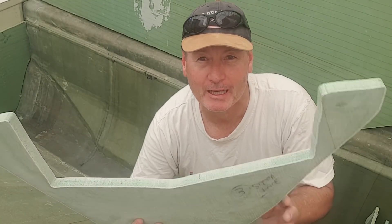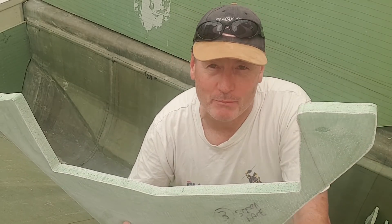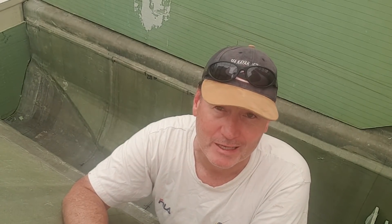I'm going to glass them in. I've got to put a layer of Sealight adhesive — ProBond light — in here, radius it, and fill it up before I can glass and tab those in. Remembering when I laid up the hull, the entire hull section here was peel-plied. It's been about 7 or 8 months since I've actually glassed anything in here, so I'm going to give it a light sand to clean the surface — just to make sure it's as clean as it can be. Even though it was peel-plied and the peel ply has been removed, there's still going to be contaminants: dust, possibly some moisture. It's 42 degrees in here today so not much moisture, but it's so important to keep it clean. I've vacuumed this section out, then I'm going to sand it lightly, then wipe it with styrene before placing the bulkhead. The filler is Sealight bedding compound — it's an Australian product designed for GRP materials and it'll provide a perfect filler.